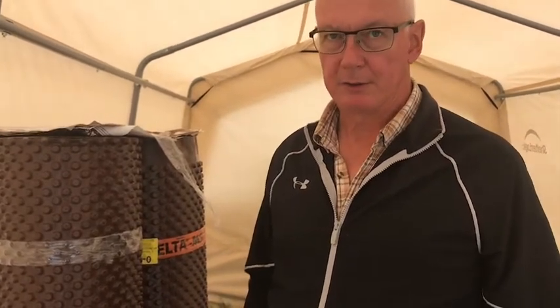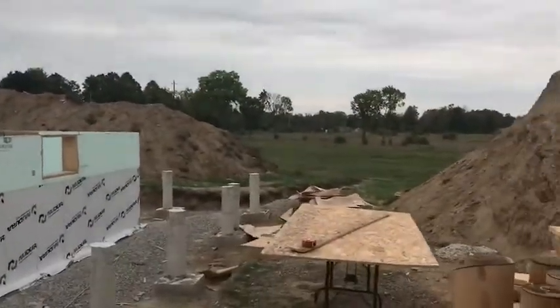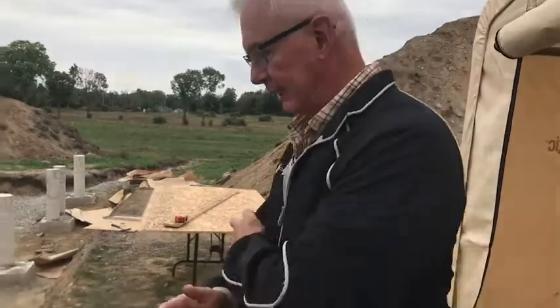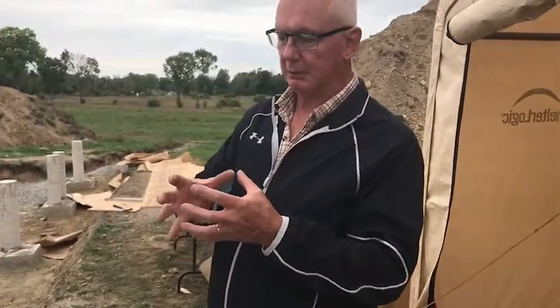Right. So we're using this stuff so that we can use our old dirt for backfill. Right. So the dirt's actually pretty good, but one thing we have to make sure of, basically any stones that are, say, double size, double hand size or whatever would be too big to be close to the foundation.